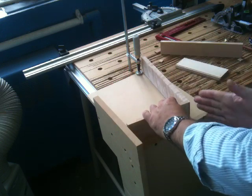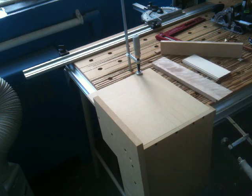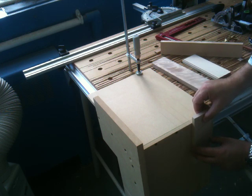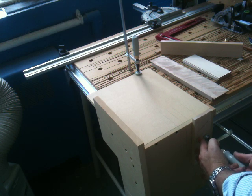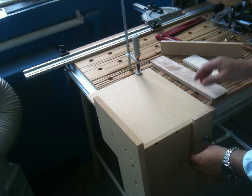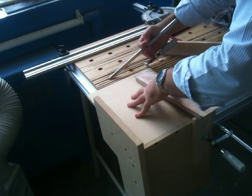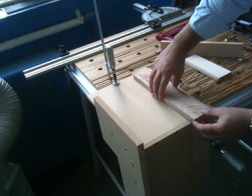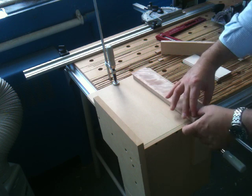You're mortising this way. So what you would want to do is clamp this piece in here. I should mention that I've drawn 90 degree layout lines just to help me in establishing this. So choose a layout line that's appropriate, and you want to leave it a little bit, well, obviously a lot proud to account for this. So this, as you can see, let me just move this to a different hole. Alright, so as you can see, there's a gap there, which is fine. I want that.